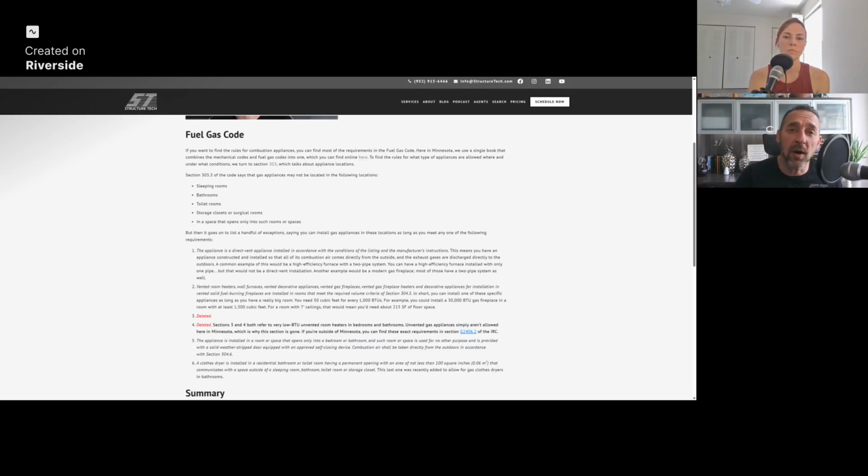But then they go on to give you a bunch of exceptions, and they say you can't have it there, but if you want to do these things, you actually can have it there. So, and I'm pretty sure we did a whole podcast episode on this, but we're going to review it really quickly. One of the exceptions is if it's a direct vent appliance and it's installed in accordance with the manufacturer's instructions and all that.